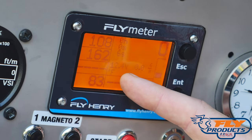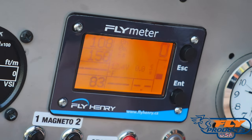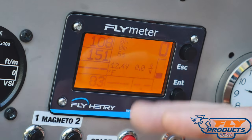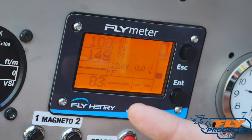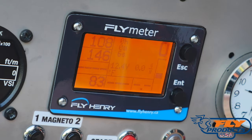Below that you've got your battery voltage. Right now with the engine off, we're at 12.4 volts. The Cosmos engine does have a charging system, so you never have to worry about charging the battery. If we started the engine and ran it up, you'd see the voltage go up into the 13, maybe even low 14 volt range, as the engine produces power to charge the battery and power the panel systems.